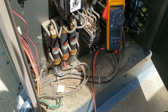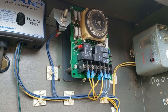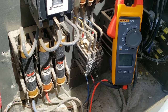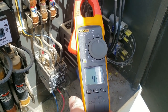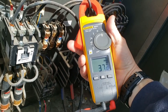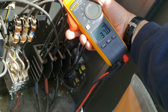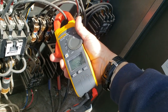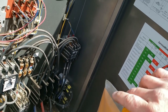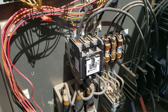Everything's looking pretty good. Just to say we've checked everything under the sun, I'm going to head through our defrost — see what we get, make sure she calms down, shuts down, and that strip heat comes on. There she goes — interlock, 43 amps. Readings are showing 37 on the others — only one of them is a little weird, 33 there. I'm not going to leave it in defrost too long, so turning that back off. Disengage.